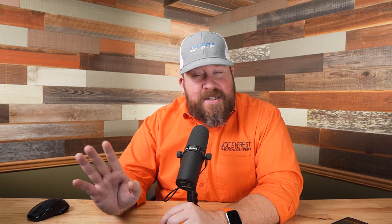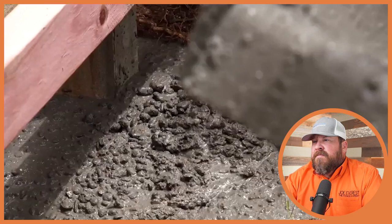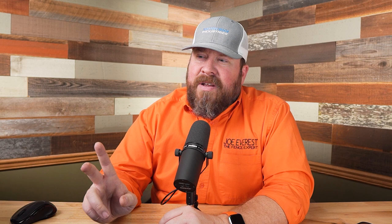Time to pour concrete in the hole. Miter 10 is clearly a fan of wet setting, which is a discussion ongoing in the US — wet set versus dry compaction versus driving. The Miter 10 host says to let it set for 24 hours, but the reactor pushes back: 24 hours for standard concrete mix is a little quick. Typically 48 hours is where they'd start, and that's if it's warm and dry. If it's cool or damp, give it longer. Fast-setting concrete is done in hours, but this looked like standard concrete, so 24 hours might not be enough.